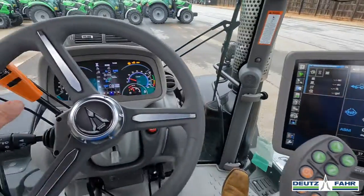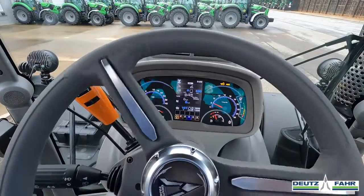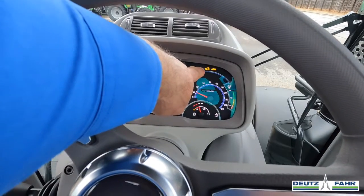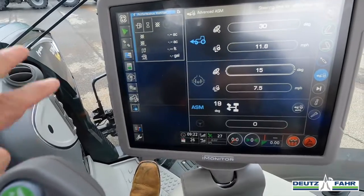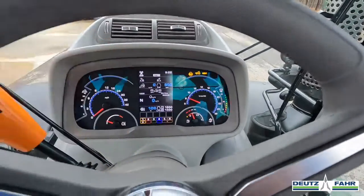I'm going to start turning the wheel. My wheel went past 15 degrees, and you notice the differential kicked out — it's not lit up here or here. I'm going to turn the wheel back, and you see that kicked on and it's also lit up there.